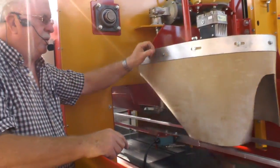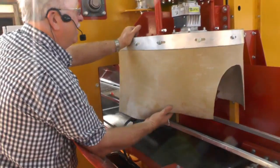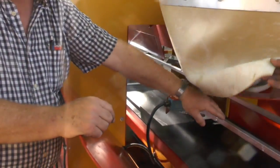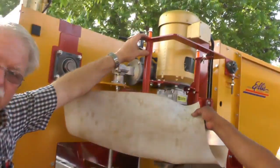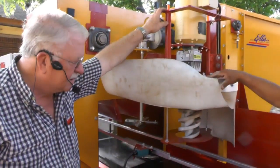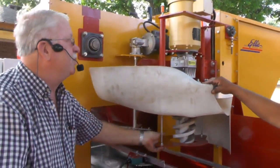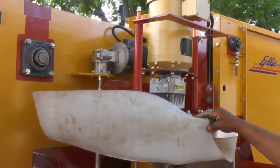And another thing that I wanted to show you, if you'll push up on this plate, well, you can see it right here. Run this drill down in manual until it touches on this rail, and spray these rods with WD-40 every day before you start running. WD-40 evaporates. It's got fish oil in it. It won't collect dust and dirt like a lot of things will, but make sure that this rod right here, just spray WD-40 down in here and keep it done.